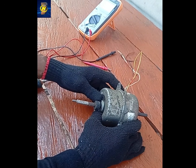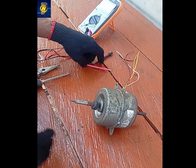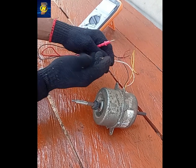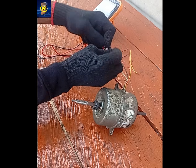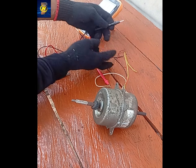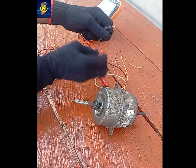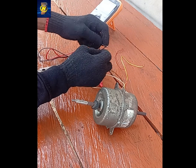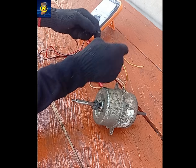This motor you're looking at was never designed to generate power, but today I'll show you how to turn it into a permanent magnet generator. How to convert an old window AC motor into a powerful permanent magnet generator — PMG. This process turns a normal AC induction motor into a self-excited generator by adding permanent magnets to the rotor.